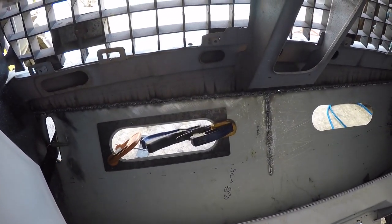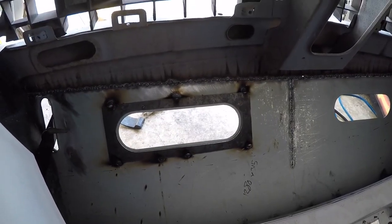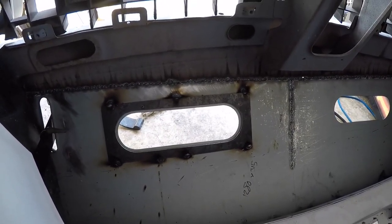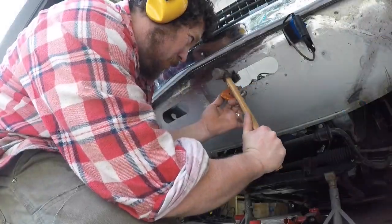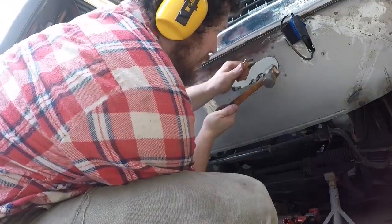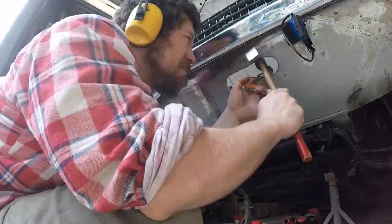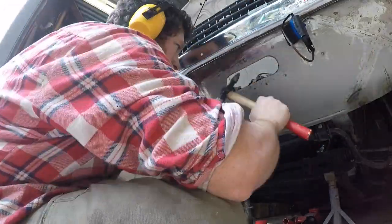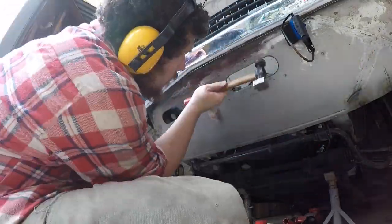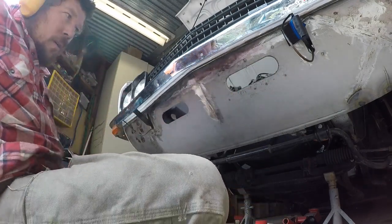For that — you've seen me do this a couple of times — I just made a little metal die, tack welded it on the back, and then went around with the hammers. Taking it easy to make sure I don't dent the whole thing in, trying to hit down onto the metal at about 45 degrees rather than straight in. Took my time, and all I really needed to do after that was tidy it up with a file — didn't take much at all.